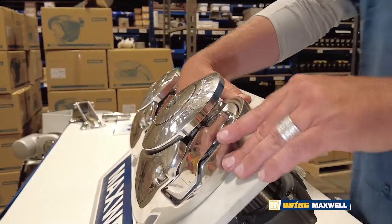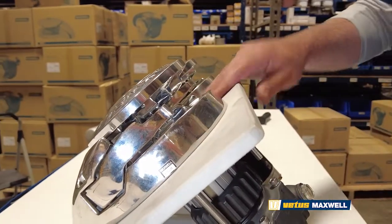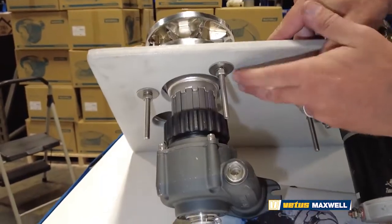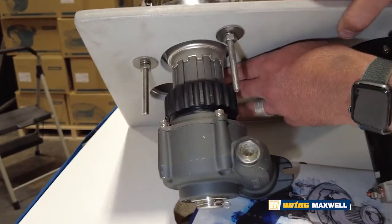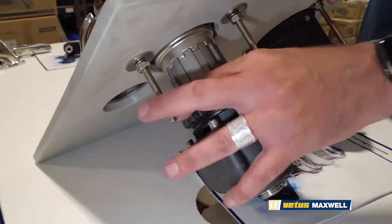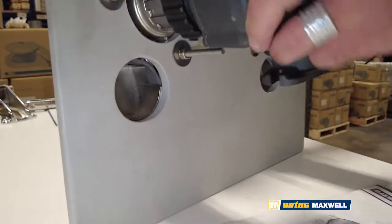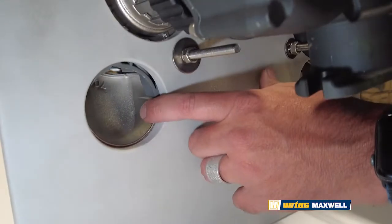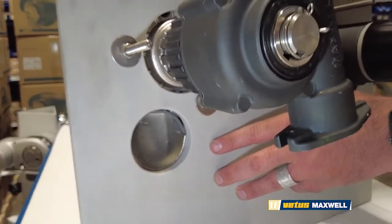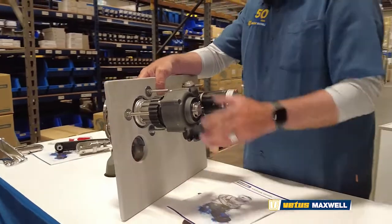The stripper wheel is the same. Your clutch nut is just about the same with your star series on it. And underneath, if we come up under here, we're going to see that the mounting holes are the same — should be a direct replacement, with your three nuts and bolts and your gearbox with the clutch nut on here.